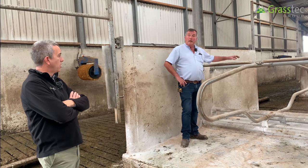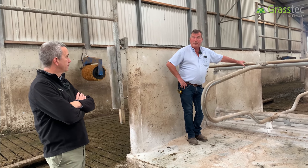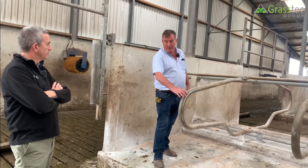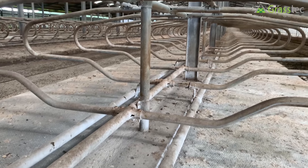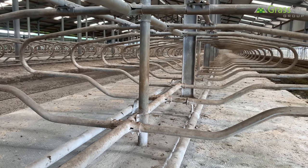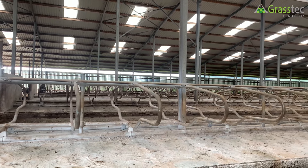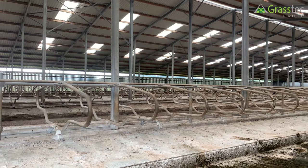When asked what 'not flaked in the corners' means: some pipe that is manufactured is not certified for tube bending. This pipe is certified for tube bending so the galvanized doesn't crack. There was a time they had piping come in where one bale was perfect and the next bale all flaked, making it obsolete. They had to pay extra for the certified pipe.